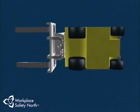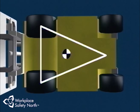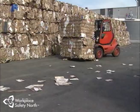When the forklift is traveling without a load, its center of gravity is in the middle of the stability triangle. But when the forklift picks up a load, the center of gravity shifts forward. When the lift truck is loaded to capacity, the center of gravity shifts closer to the edge of the triangle, increasing the risk of tip over during sudden stops. But as long as it stays within the triangle, the lift truck remains stable.